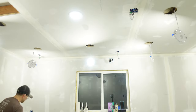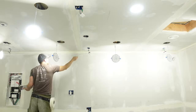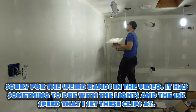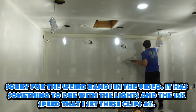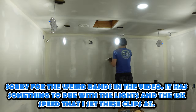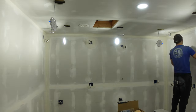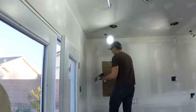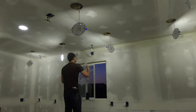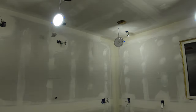You want to make sure you don't have any areas with open pieces of drywall because that's where cracks are going to start. The whole process for me was putting down some mud, taping over the top of the mud, putting a little more mud over the tape and scraping that off just to get the tape nice and moist, then letting it all dry. I used alternating days to mud over that tape over and over again until I had a nice flat surface. As for the butt joints, you could tell which ones those are on the wall because they aren't little skinny lines — there's an entire section of wall that looks mudded over, and as a total novice I had to stretch those out pretty far otherwise you would definitely see them.